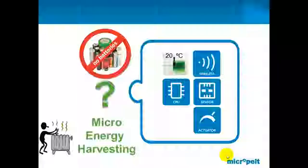Yeah. So how can we activate this sensor? Every project that we are in contains a microcontroller. Many projects include radio, not all of them. Imagine I have an operational counter for a machine, and the data is stored locally. There is no radio. That is a pretty easy one, because radio usually eats the most energy in the equipment. In certain applications we will see later, we even have a motor. It's also a challenging one. A motor eats quite some energy.